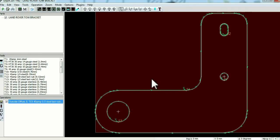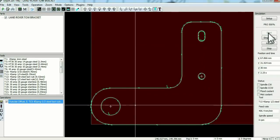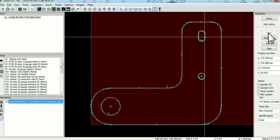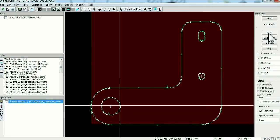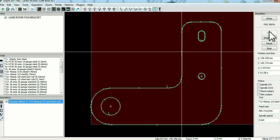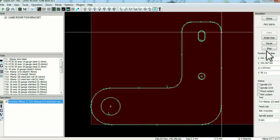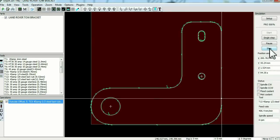From that we've actually got a cut path now. We're going to do a simulation on it. You can see it's going to cut the holes out first, cutting from the inside of the hole. Now it's going to cut the part out from the outside, so there's no damage to the part. It's obviously going to cut a lot slower when we're doing it for real on the material.